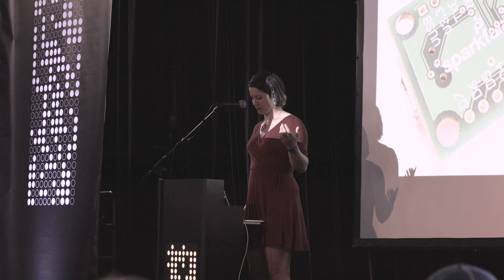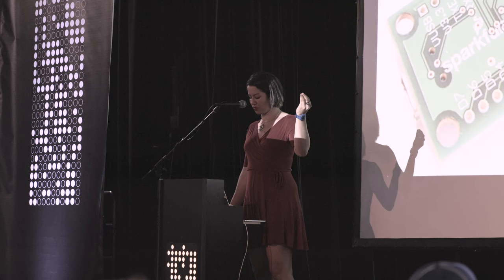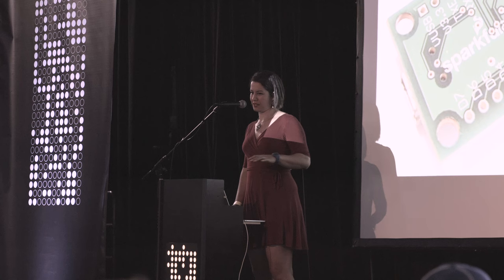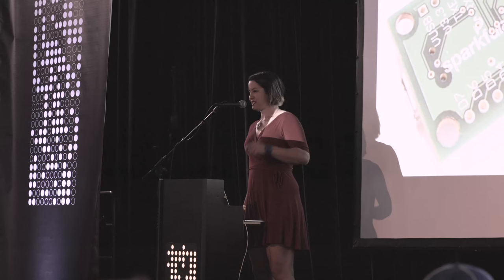Tenting is a process where the solder mask covers over the vias. So you can see on the left, instead of the holes having large copper radiuses around them, or large exposed metal pads, the solder mask creeps up and nearly closes them over. And sometimes, it's worth noting, tenting vias does cover them over entirely, and you can run into issues. If you're tenting on both sides of your board and etchant gets trapped, it can just eat at your board forever until that via stops working. So you want to avoid that.